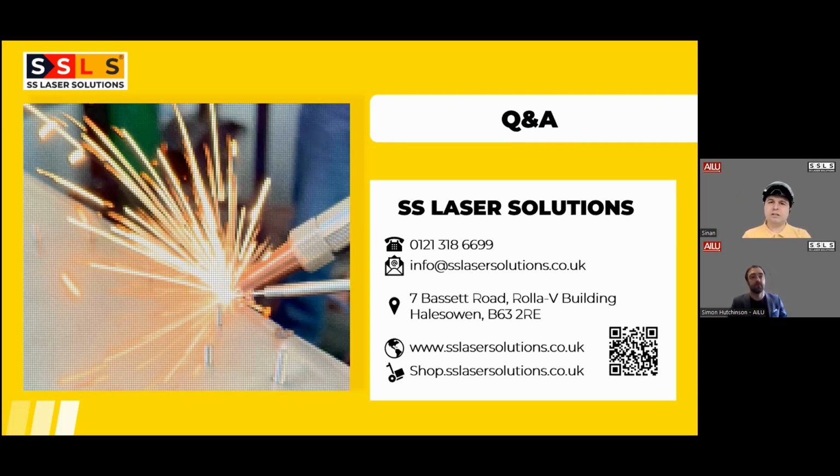It can be the protection lens. So you change the protection lens and try it. If you see that the power came back to normal, go on welding. But if you see that there is still a power loss, then you should suspect the focusing lens. Change the focusing lens, and if you still have that problem, then we should be checking the collimation lens or reflective mirror. And in the worst case scenario, you might have damaged the fiber cable as well. This is very rare, but these are the scenarios.